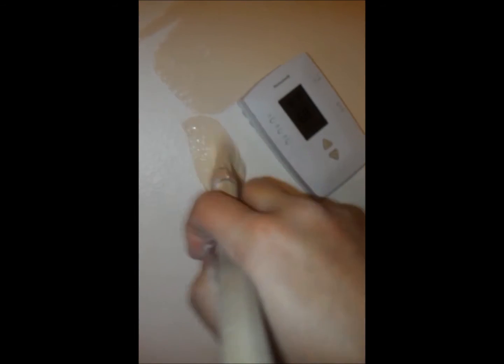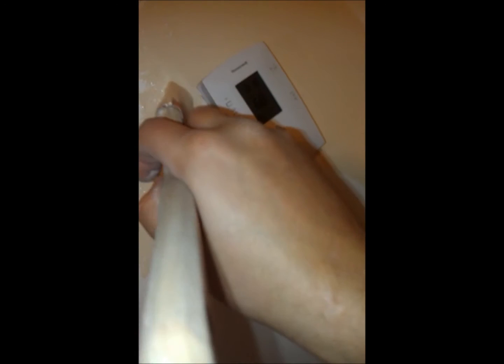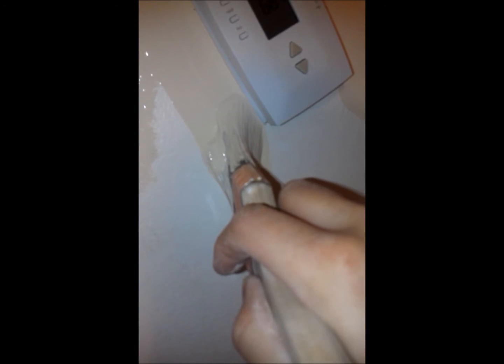Now I'm feathering it out. I feel it's getting a little light, so what I like to do sometimes is just scrape off what I just put on back onto my bristle. Now it's a little heavy and my bead is kind of heavy as well, so I went off to the side. Now I'll go the other way just to get into the spots. This is ready for rolling after I put tape on the top to catch some of the flakes that have come down.